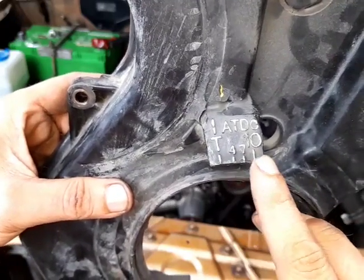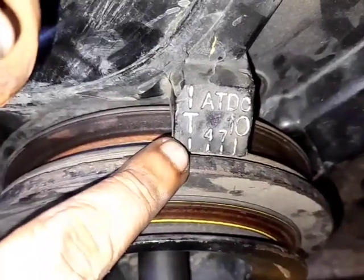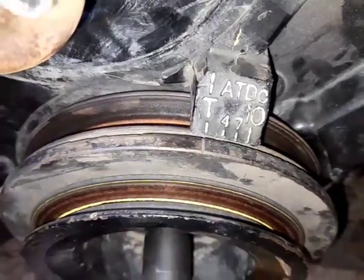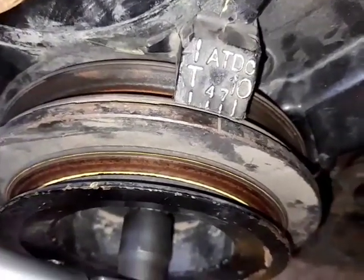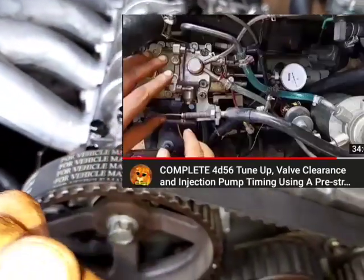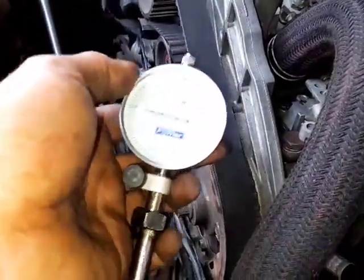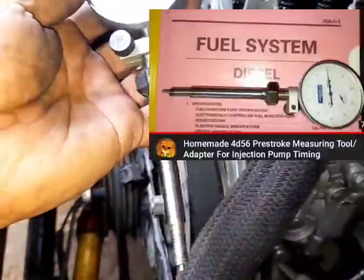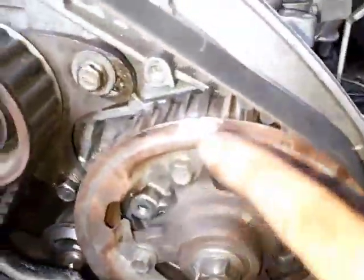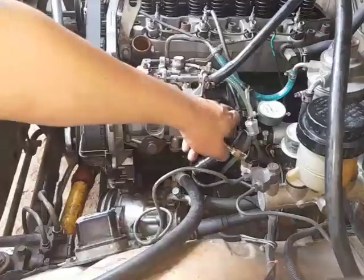These timing marks are intended for us to set the timing of the fuel pump injection. Top dead center is for cylinder number one, and as we turn four, seven, or ten degrees, that is when you want diesel to be introduced depending on the type of cylinder head you have. You can only truly verify when diesel will be introduced by using a dial indicator as well as a pre-stroke measuring tool, by inserting it here — and that's what we will do to find out what advancing one tooth would do.